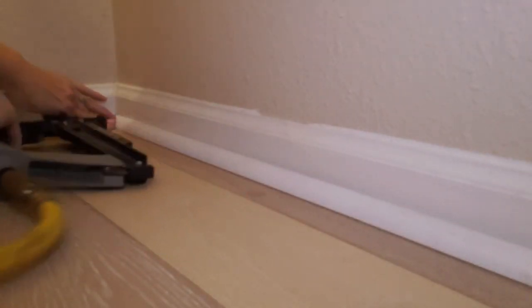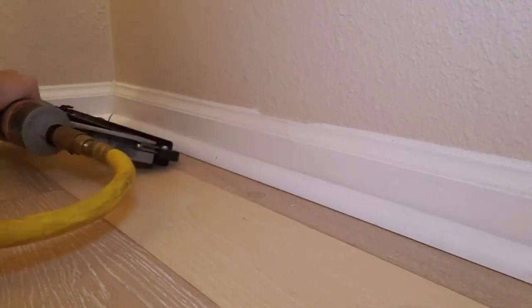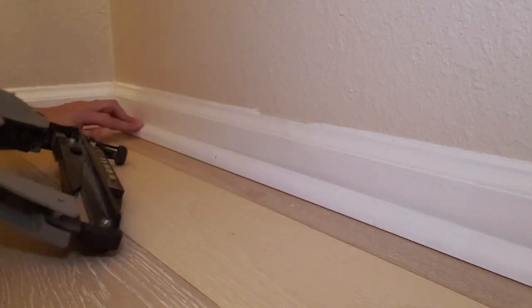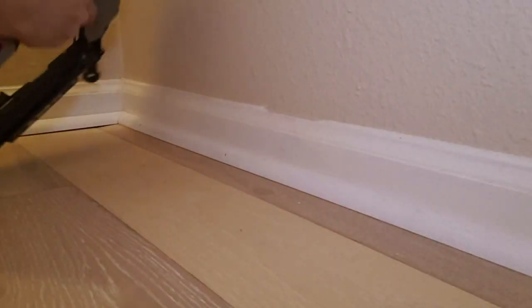So this is that 45 degree angle. It's an inseam angle. So those cuts were 45 degrees and they match up perfectly. And that's how you finish the trim if you're not going to remove the trim when you're installing the wood floor. So you do want it to have that space. You just add a quarter round to it, and then everything looks perfect when you're all done. Caulking it makes it all look like one solid piece. And it's a very simple process.